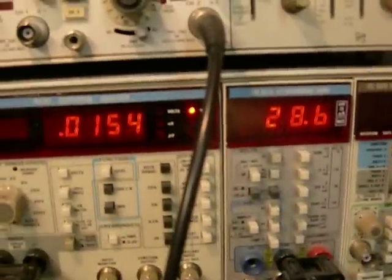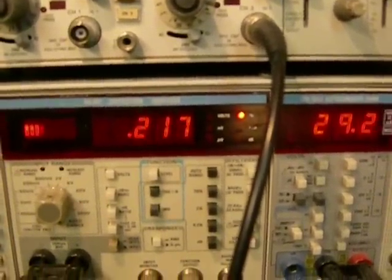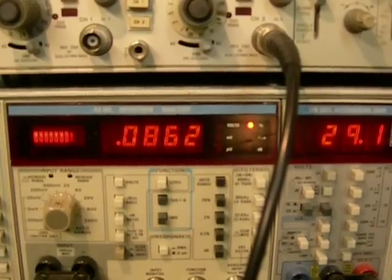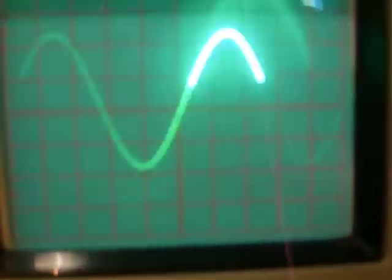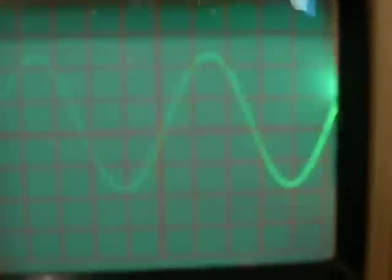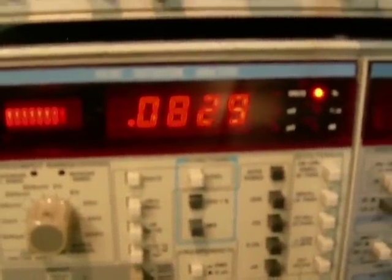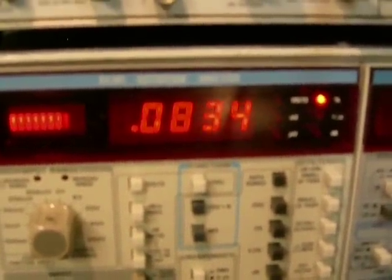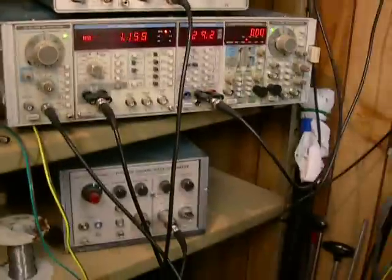There's the other channel — very good. We don't see the little anomaly at the bottom of the sine wave, so our distortion is not jumping around badly: 0.08 percent, holding up very well. Check our resistors — yes, they are hot. Turn it back down.